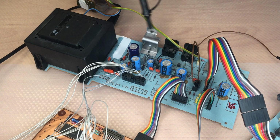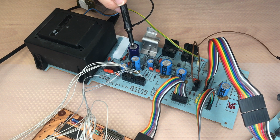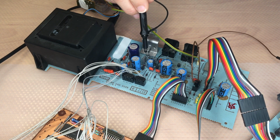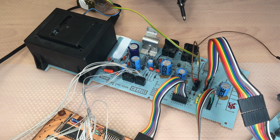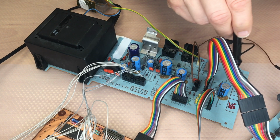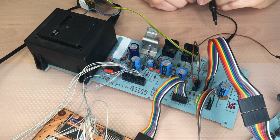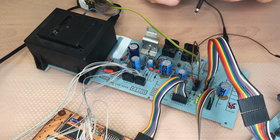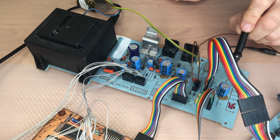And when we are going to measure the voltages, what you will see is that the voltages in the service manual are completely different to the voltages we measure here. They're all higher. So 9 volts might be 12 volts, although we already switched to 240 volts. So before, it was even higher. There are some undocumented parts here. We'll quickly realize when we flip over the panel, that's not documented, and there's also a fusible resistor which was gone on unit number 2.